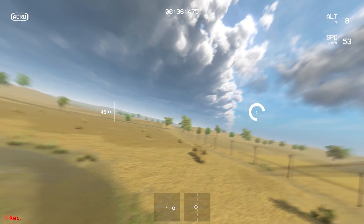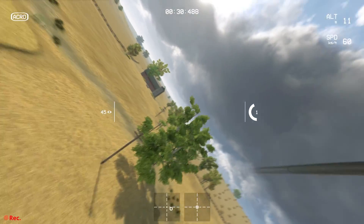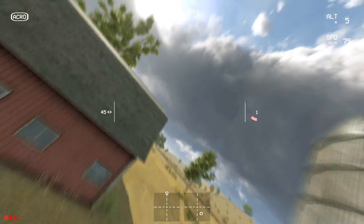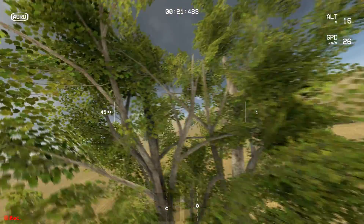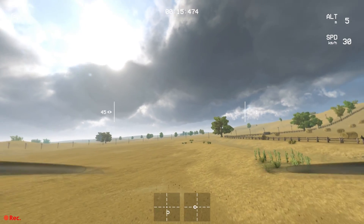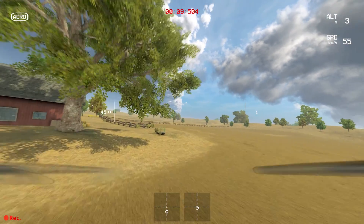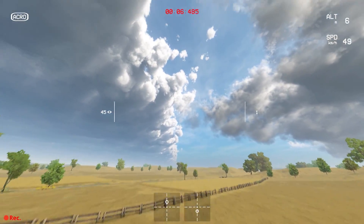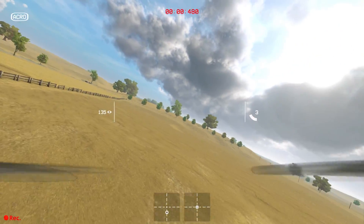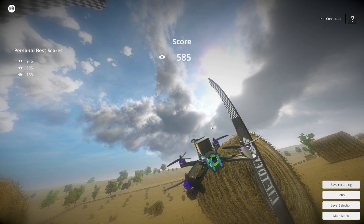It's all backwards. Something's wrong — I have to go back through settings because my yaw is backwards. The main point of this video was: does it actually work with the DJI remote? And the answer is yes, it does. You do have to go through calibration, but it looks like we need to reverse the yaw. I'm going left and it's going right, so something is definitely up there — just some fine tuning.